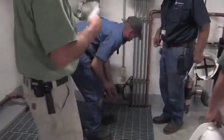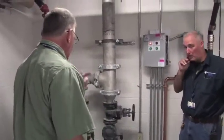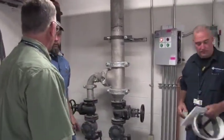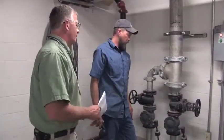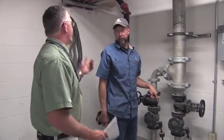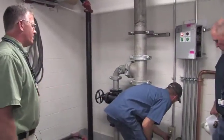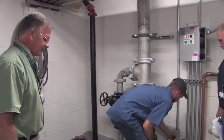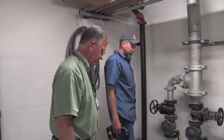I'll plug that and you guys will probably put the power to that when you need it. Actually, I leave it plugged in — in case there's a little bit of water, the little pump takes care of it. We don't need to run the big pump for that. Because anything that comes in is going to be a real big rush and that little pump won't keep up — once the big pump comes on, it's no problem. So I just leave it plugged in — it'll just maintain.